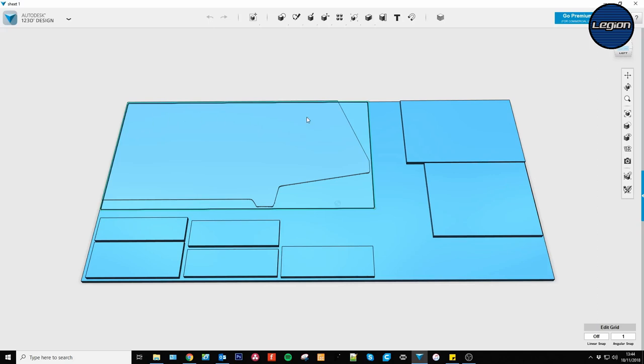This is the side that I imported from the files that I got from classicarcadecabinets.com. And I used that as the base to figure out what cuts I wanted to make. So normally I would get them to cut this piece out to match the side, and then whatever was left, I would ask them to cut to the width of the cabinet so that all the pieces are the same width with straight edges, and that would just make life so much easier.